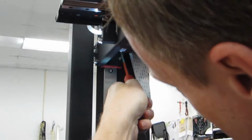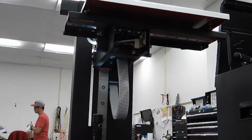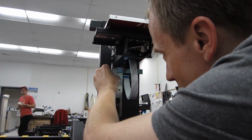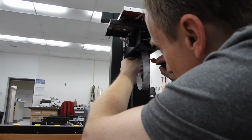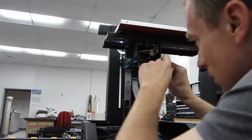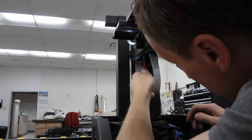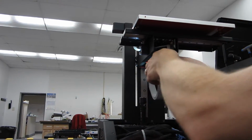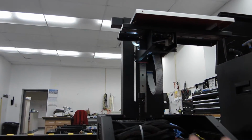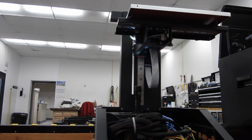And anytime you're working with machinery like this, sometimes the act of tightening the screw may shift things, so always check it a couple of times as you're proceeding. Make sure everything's still square. I'm just going to go around and make sure everything's torqued down nicely. Once you got it to the level that you wanted to, did you tighten any particular screws first, the bottom to the tops? Just go angle, like corner to corner, corner to corner. Okay. That's just good practice.